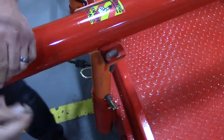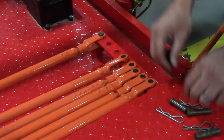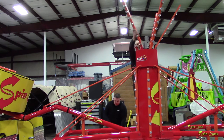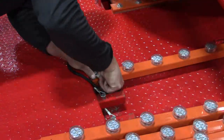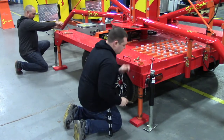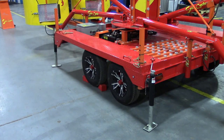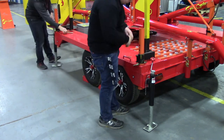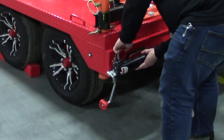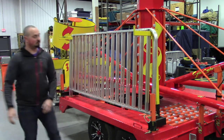Next, the spreader bars will need to be racked for transport. Start by sliding all of the spreader bars in and slide them all the way over so they all fit. After they're all in, one by one, secure them to the transport rack with a clevis pin. Once the spreader bars are secured for transport, unplug and remove the light bars from the crown and install them back on the light bar transport brackets. Make sure that the pin is placed and secured in each light bar. Next, raise the ride by lowering the stabilizer jacks, then remove the pin from the jack feet and raise them up as far as they go. Insert the clevis pin on the top side so it doesn't slide down during transport. Reinstall the fence rack and put the second clevis pin above the fence rack sleeve. Next, raise the stabilizer jacks and swivel them for transport. Repeat these same steps on the other side of the ride. Finally, rack the fencing, strap it down, and hook up the ride to the transport vehicle.